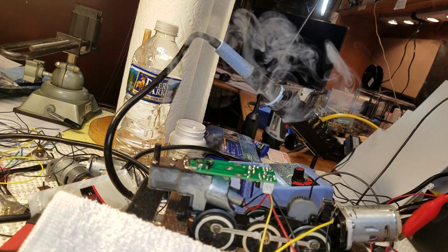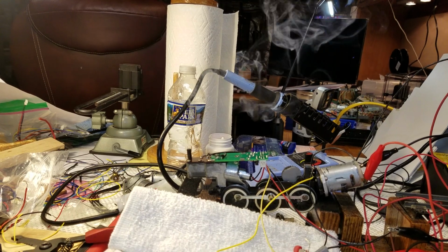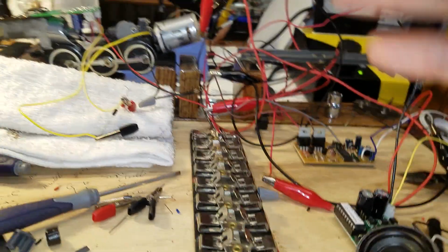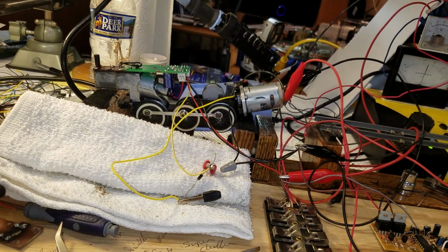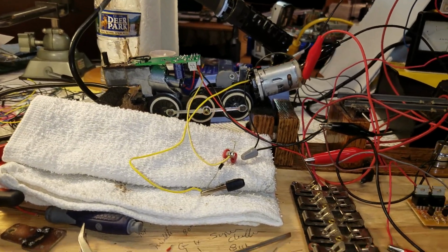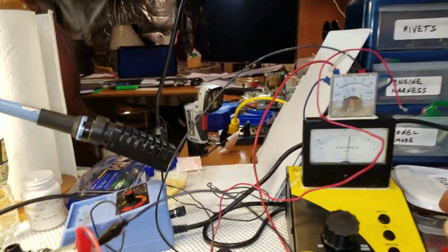And even if I wanted a bigger puff, I'm not going to get it. And part of the couple problems here is I'm not getting any voltage because I'm using a conventional DC. I say conventional. It's a Lionel DC controller, which runs a DC motor fine, but it's not a wireless controller like the TMCC or the MTH DCS. So I don't have 8 or 9 volts at the track, and then adjusting the motor RPM remote control through circuitry. I'm adjusting motor control through voltage, and as you can see, I'm less than 5 volts.